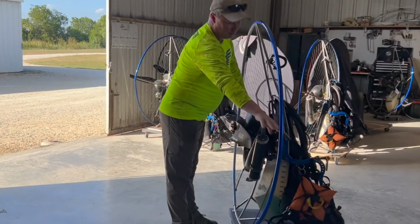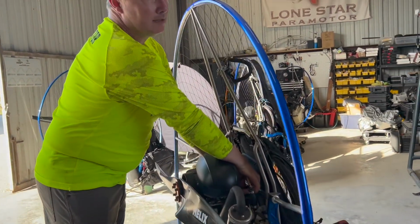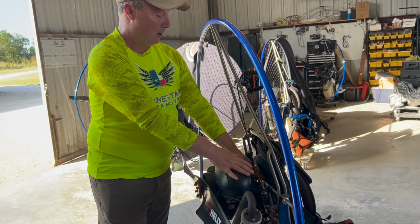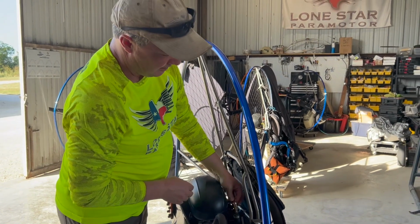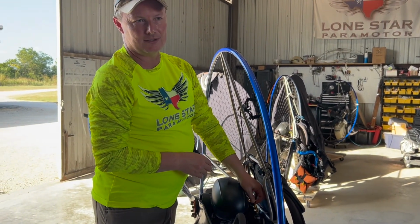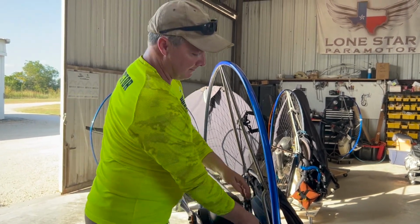And I got the cross supports here. I'm checking the swing arm attachments, make sure they're good. Make sure the motor mounts are in place and they're good. You'll see some electronics or some wires in here. This is usually part of the kill switch. You're looking for any obvious damage with that. I like to pinch the fuel tubing because if you pinch it and it still flexes, it's pretty good usually. It might still have a pinhole. You have to keep an eye on that.